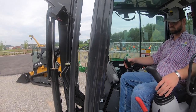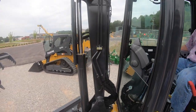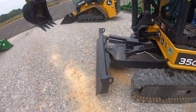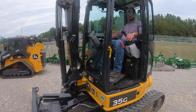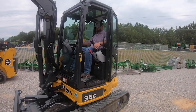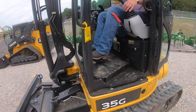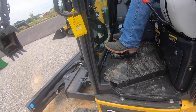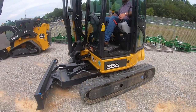This machine is also equipped with the angle blade option. The angle blade option — basically when you're going up and down with the machine, you can use your thumb to push a button to control that. The angle blade is going to increase your cover time 20% just by having it. One of the other cool things is, while you have your hand on that blade and you're covering, you can't have your hand on the track controls and the blade control at the same time — but they are also offered so you can operate the machine and control the blade simultaneously. So now you're basically utilizing all your functions at one time and everything is right there where you can get a hold of it.